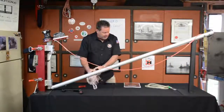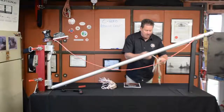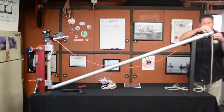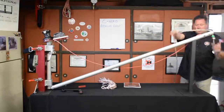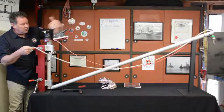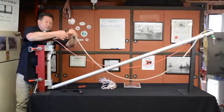This does come with 45 feet of lift line with a hook and stopper ball. You're going to take your line to the bit, and you're going to come from underneath — this is the lift side — and come in here like this. We're going to put it in and come back here to the rope clutch. The rope clutch: when open, the line will come and go. When it's closed down, it's a brake — it will not allow the line to back out. It's a secondary brake. So you're going to feed this line in here like this.